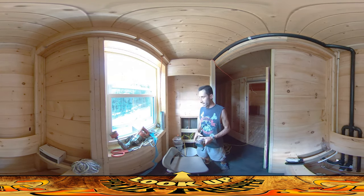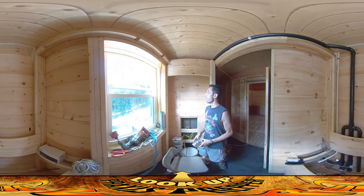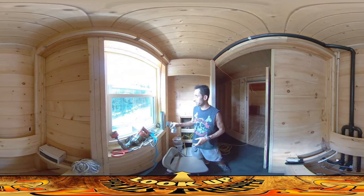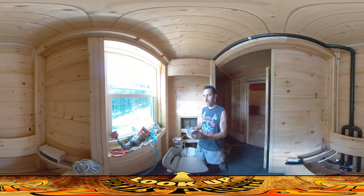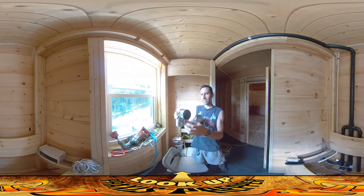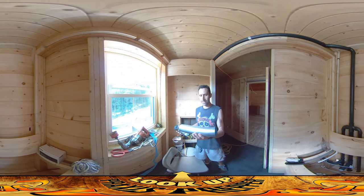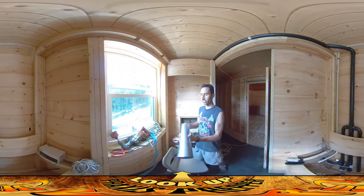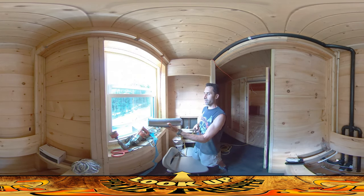We've got one here and one below and I'm making them so they'll come down right next to each other. I'm about to cut this hole here, but what I wanted to talk about is a technique I just learned — I've been practicing it. My dad answered a question I had because I had this little piece of scrap from the pass-through downstairs. If you're familiar with these pieces of air conduit, it's got one female side and one male side that has these little pleats in it — one goes inside the other. This piece was cut so it didn't have the male side, and I was asking my dad if he had a tool for creating the male side with all those pleats. He said you can actually use a pair of needle nose pliers.